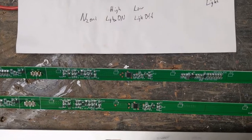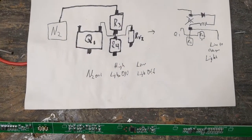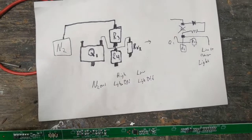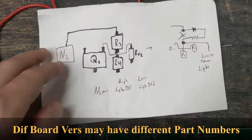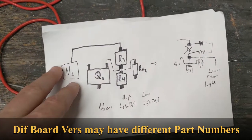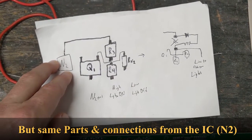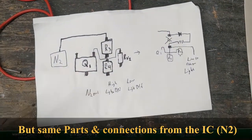I'm at the point where I'm going to modify my circuit to tie these two together. Internal to here you have N2 — it's a microcontroller. It transmits and receives the IR right there. I think it does pseudo-random code because looking at it, it looks like there are random bits being generated in and out, so it compares input and output. It knows that if it's detecting stuff on the transmitter, the door is closed. If it's not, it drives the circuit high and turns on the light.